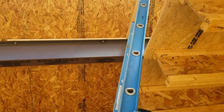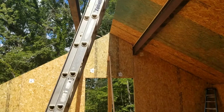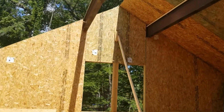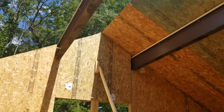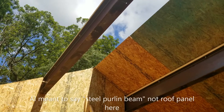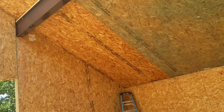In this case, the steel bears on point loads that are on either side of the windows. The roof panels lap at the ridge to create a moment connection, and in this case the roof panel effectively shortens the span.